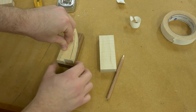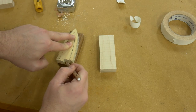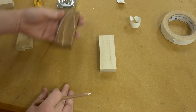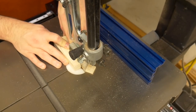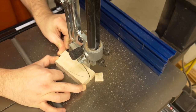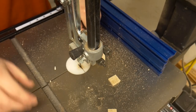Next I'm going to use a sharp pencil to outline and trace from the template. With the templates traced on, I can head back over to the band saw and cut away the waste. With this project being so small, I didn't have a whole lot of room for error, so I played it as tight as I could to the line, making sure not to remove the line with the band saw blade.